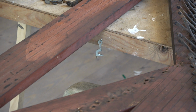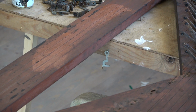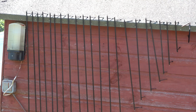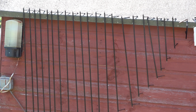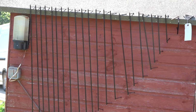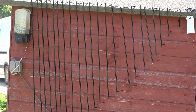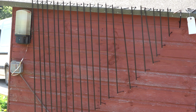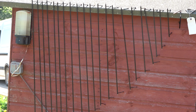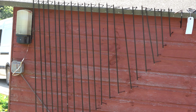What I've done with the rollers, we've brush painted them and I've put them outside. I've got a shed just outside and I've got them drying in a rather clever way. I'll show you. There they are, hanging by the roller arms from the roof of that shed. All in order. So that's one reason to do them in batches. Things are done in two sections on this organ. So the, shall we say, the bass end of these ones, the treble ones you've just seen, still in situ. So we'll put these back and we'll take the other ones out and treat these in the same way.